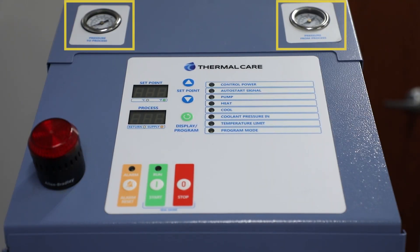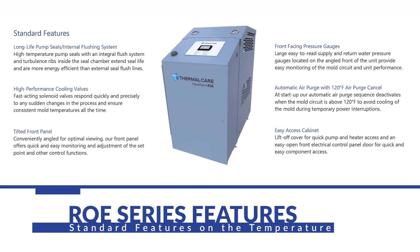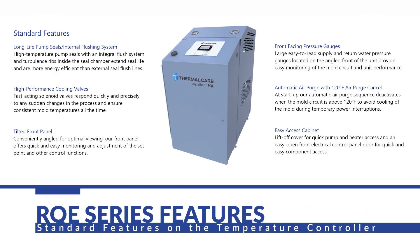It also shows a supply and return pressure gauge that can be seen while operating the unit. The standard and premium controller units incorporate solid state relays that also utilize a fan in the panel to keep the components cool and extend their life. The control circuit is 24 volt DC, which helps protect the control circuit from any sort of interference and allows stable, consistent operation. The controller will automatically purge air from the TCU loop at startup, unless the system is already at 120 degrees Fahrenheit.